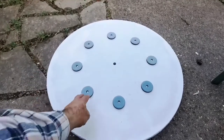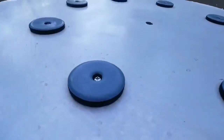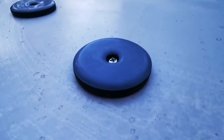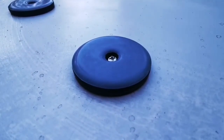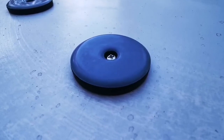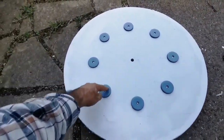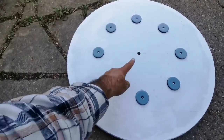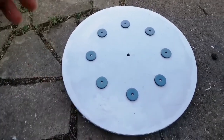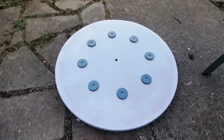For the base I placed eight Teflon pads. They are made of a layer of rubber, then a washer layer that the screw fixes on, and the top gray layer is Teflon PTFE. I've placed eight of them and measured 18 centimeters from one side to the other on the base — a little bit more than halfway. Now it's moment of truth — I'm going to see if the bolt is long enough to fit.